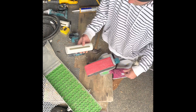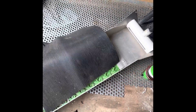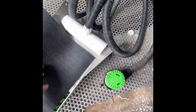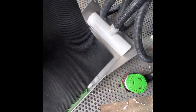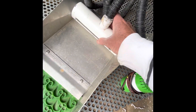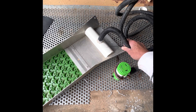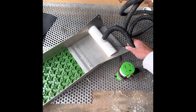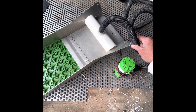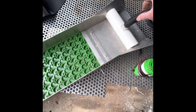And there you have it — a very quick, cheap and easy header box that you can now fit into your normal sluice and use it to run your concentrates. It's a good idea to replace your mat with some vmat, or just put a bit up the top — it gives you a good indication of what you're actually cleaning up. Bilge pump, hose, straight to your header box. The angle of the header can be changed anyway just by altering the angle of the pipe going in there, and I do that with a simple zip tie going to the corner of the sluice — pretty easy, nice and tight. It runs a bit like this.